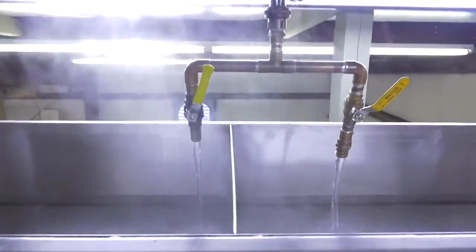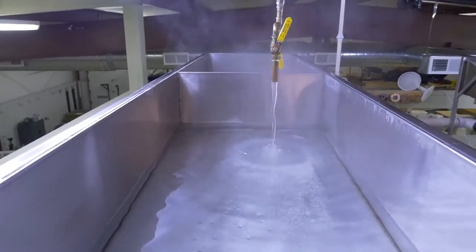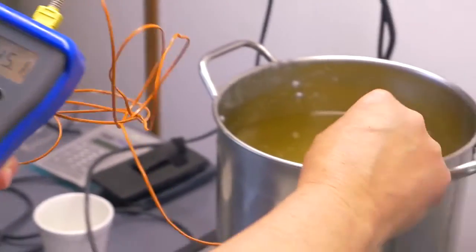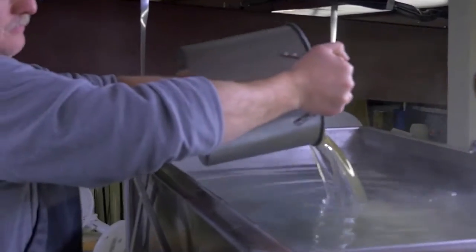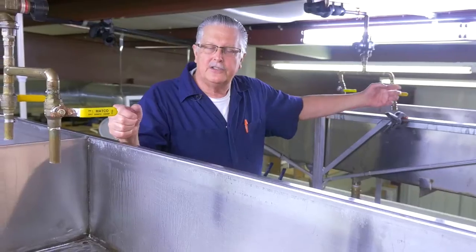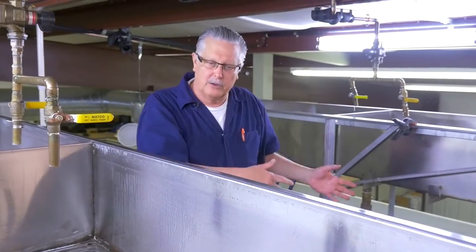What we have here are two stainless steel sinks and they each hold 100 gallons of fluid. We will fill them up with water at 150 to 160 degrees F. After the water fills up the sink, we will also add lard, which is preheated to the same 150 to 160 degrees F. We will add 10 pounds of grease here and 10 pounds of grease lard over here, dropped over about a two minute period of time — a total of 200 gallons. Dropping in two minutes gives us 100 gallons a minute, which is the flow rate for the unit we're evaluating.